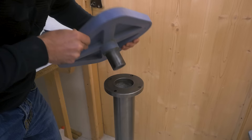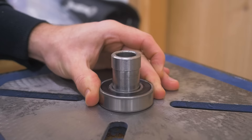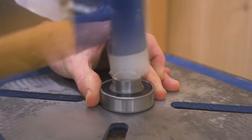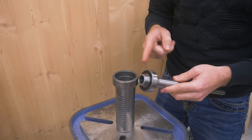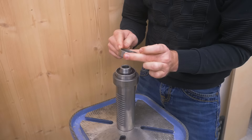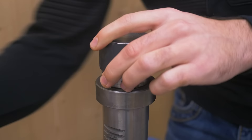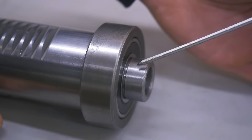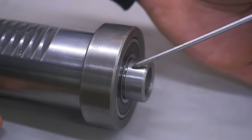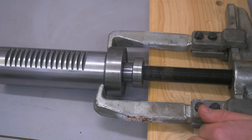For the front spindle bearing, I could also use the drill press table and the drill press column for a long through hole. To install it here, I use the same setup, but now I should only hit the bearing on the outer race. So I disassembled one of the old bearings and can use this outer race and a chunk of steel to do that. Surprisingly, the recoil from this drove the shaft a little bit out again, so I'm driving that back in with the gear puller — and that's okay because this is the same kind of load the bearing will experience during use.